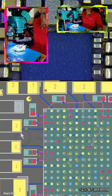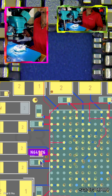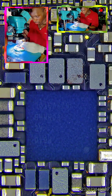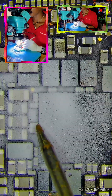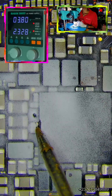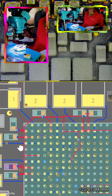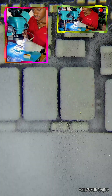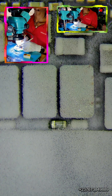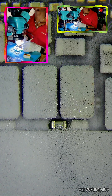From the other pixels, I removed a short in a similar case that I uploaded recently. We will do the same thing — inject voltage into the same capacitor because at times it's the same one, but it's not the same capacitor right here. If you take a look at that other capacitor, you can see that it's heating up. We use our board mapping to confirm if that's actually a component connected in parallel, and we inject the voltage again — that's a capacitor connected in parallel. It's heating up, which means that capacitor is bad. So we remove it.